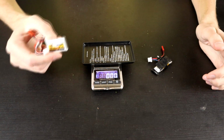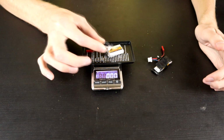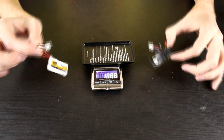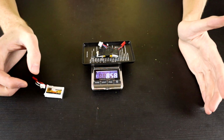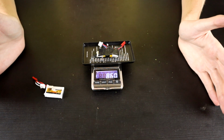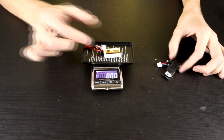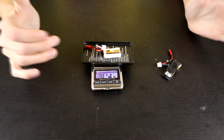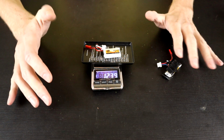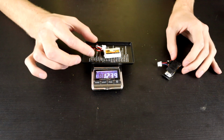Okay, so first on the list, we're going to look at the battery, because I think a substitution here could save us a decent chunk of weight. As mentioned, it's about 12 grams, 12.4 grams. And I do have this 80 milliamp hour battery, which I've proven before can run an antweight, and it is sitting at 8.6 grams. So we make almost 4 grams saving by doing this one change, which is what I need to get the whole robot running at the moment without top armor. So we still need to do something else to get rid of enough weight to make the top armor work, but that's a good start on our part.